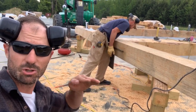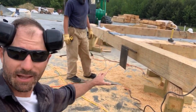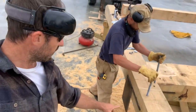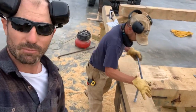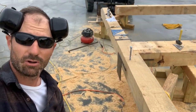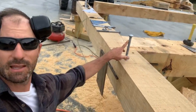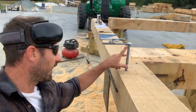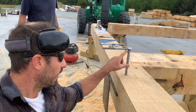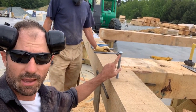We had to make two passes — we'll make a video about that and show you all about that later. But look at that, it fits in there nice and snug, we got our holes to line up. Mike's coming from the outside with the carriage bolts so that our siding can go over nice and flush. The benefit of this carriage bolt is that it doesn't have a hex head and a washer — the head itself kind of acts like a washer.